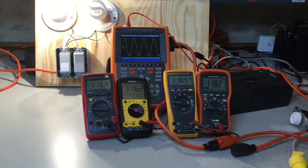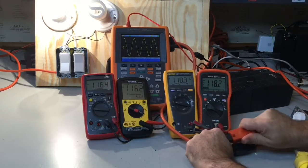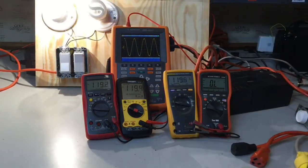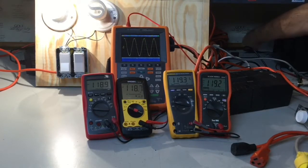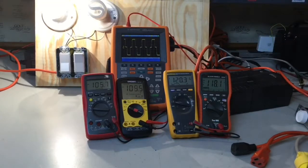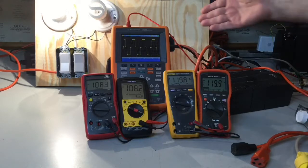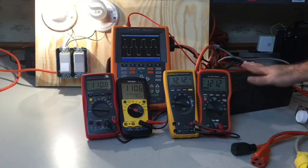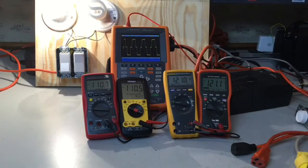Another place that you might see distorted waveforms — let's unplug this dimmer and go into this battery operated UPS. When it's plugged in I've got 120 volts and a nice pure sine wave. If power were to go out — let me unplug this. Now I'm working off of battery backup. You can see that my sine wave is no longer a nice clean sine wave; it's more of a square wave type energy. But the true RMS meters are measuring the 120 volt equivalent that this UPS is putting out, while the averaging meters are showing 110 volts because this is not a clean sine wave anymore.